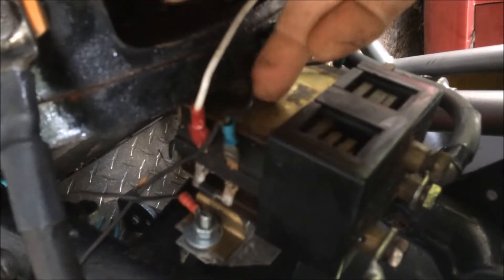The other two cables can go either way, but in general one will go to the controller and one will go to the field. Basically, electricity comes in through here and then depending on which side of this contactor is turned on, it decides which direction — either coming through this side, through the windings, out into our armature, and then back up into our controller.